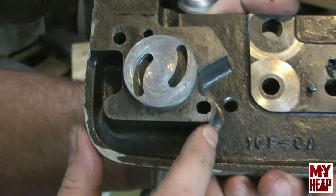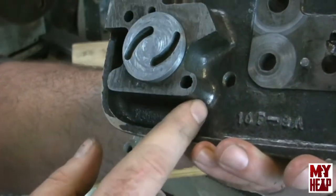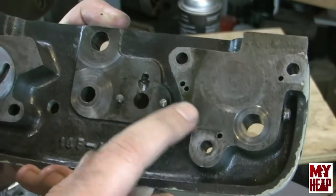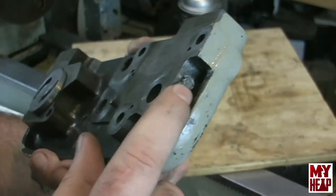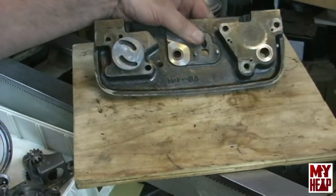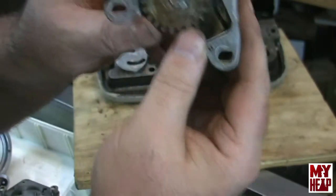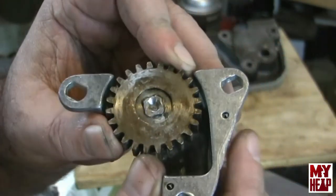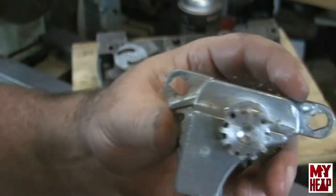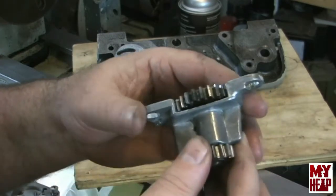I don't know if it's visible, but you see this casting is cracked along here — maybe it won't matter since the bolt runs through and screws into the part here, but I did notice that. Also, you see some little holes over here, and I have no idea what this little tap screw is for. As I was looking at the bracket while cleaning it, I happened to notice these little things that look like pins — and getting down real close, you can see that's a broken off tap there, and there. So I don't know why they were trying to tap and fasten this to the apron like that — that might explain why I have three different bolts.